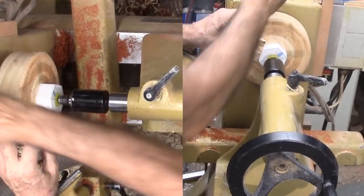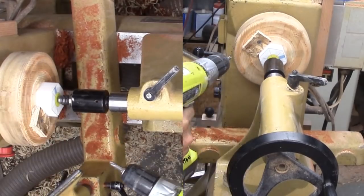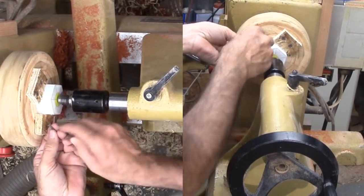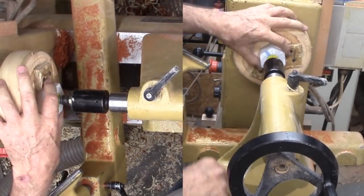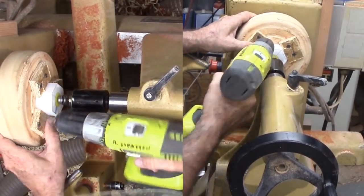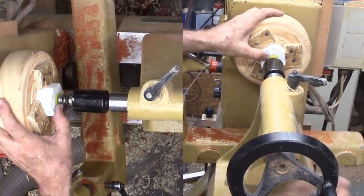Now at the lathe to tap the nut. I center punched the nut and pressed it against a threaded wood faceplate with double stick tape. I am concerned that the torque of threading would overwhelm the double stick tape with a small sticking area. I cut small scraps of OSB. Since the faceplate is wood, I can screw the scrap around the nut to resist the torque.